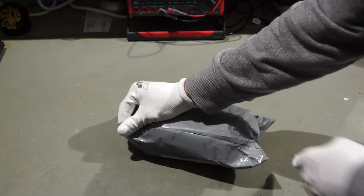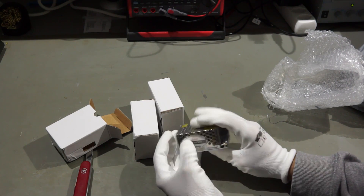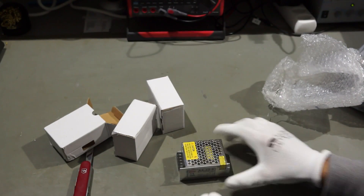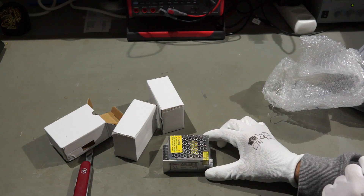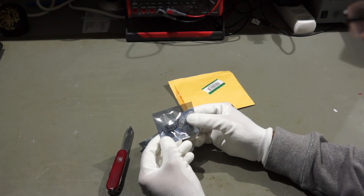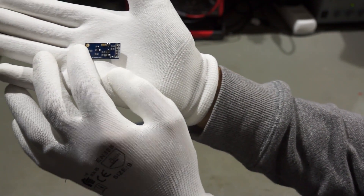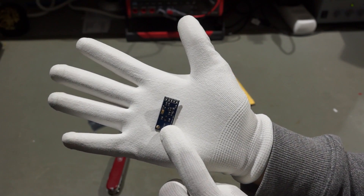Next one. Small power supplies. They are 5V, 5A. These are for my 5V projects, and especially one of these is planned to be used for the fake TV, because I didn't have a good power supply for this fake TV. Now a small one — what is this? A light intensity sensor, GY30. This is a light sensor and it has an I2C interface. This will be part of my collection of sensors, and one day I will show you one or two of them.